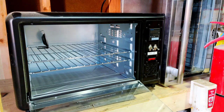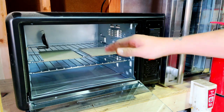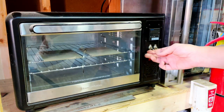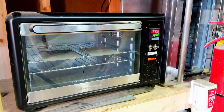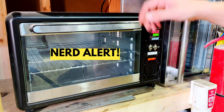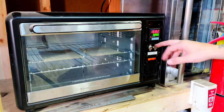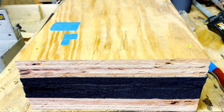You've got to heat the kydex up — you can put it in any toaster oven, but I bought this big one with a nice opening so I can put several layers in. I've completely customized it because these ovens aren't famous for being super accurate. I've redone it to my liking — wrapped the whole thing with insulation on the inside, put in a new thermocouple, a new PID controller, power switches, and a way for the heat to escape.